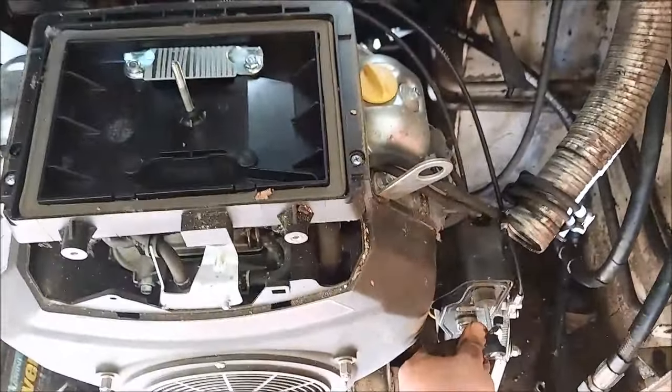So the solution to that is I'm going to take some JB Weld and clean the surface with wax and grease remover and do a dollop of JB Weld. Or I could peen this edge over with a hammer. Thought about that. But that's not the real reason why it came apart. The real reason was it slid on this shaft, even though I had this set screw in. All JB welded.